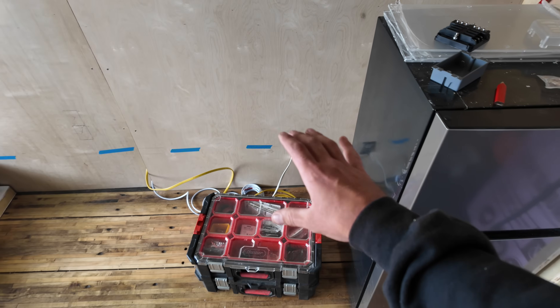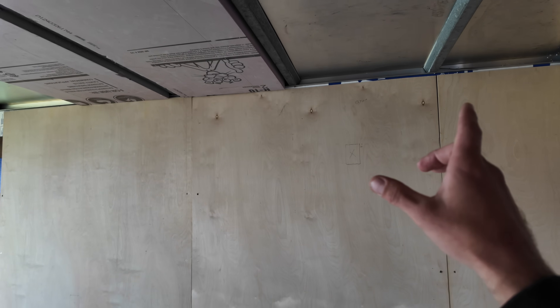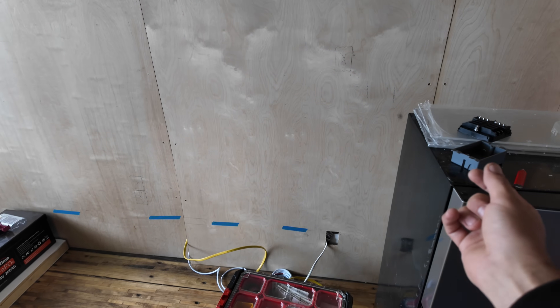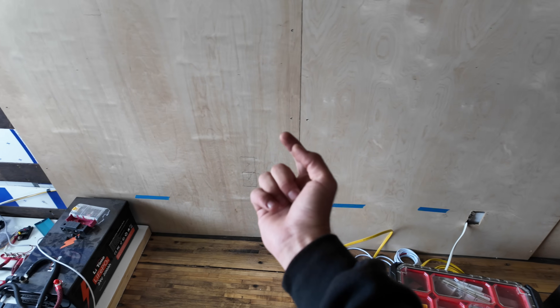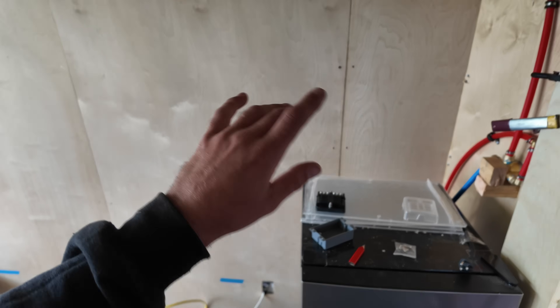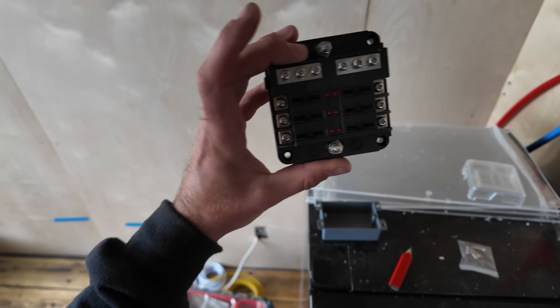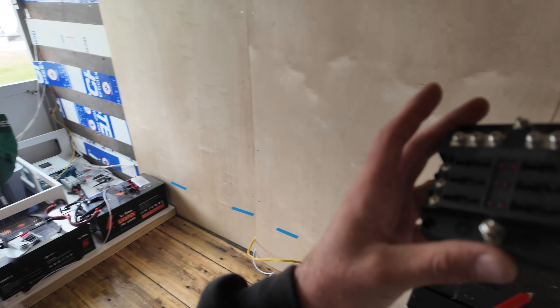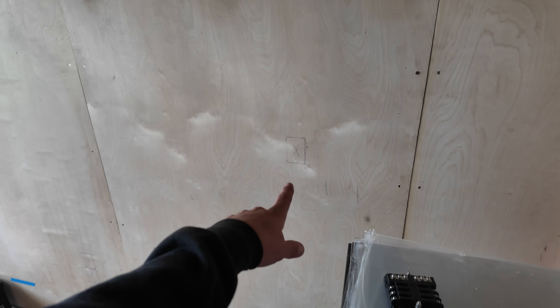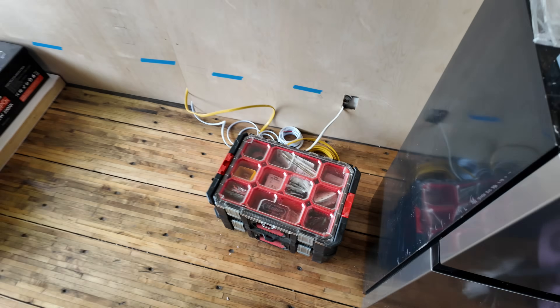The reason I'm putting another 24-volt fuse distribution block here is because I'm going to have quite a few lights: RGB LEDs on top of the upper cabinets for accent lighting, a regular lighting strip underneath the cabinet, and RGBW on the lip of the countertop and on the toe kick down here. When you add all of those together, you really need somewhere to plug in all those fuses and properly protect each circuit. I'll grab the multi-tool and cut out for these outlets.